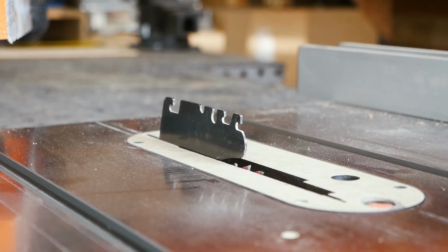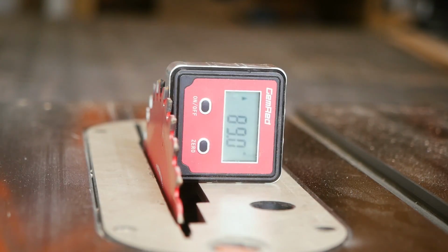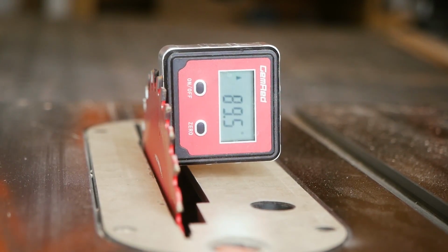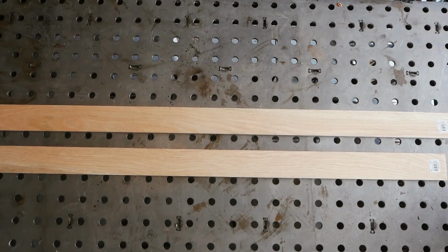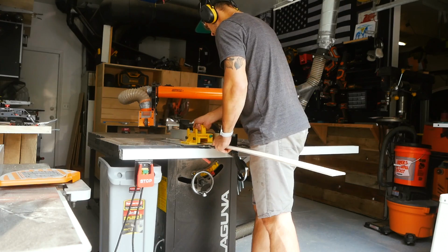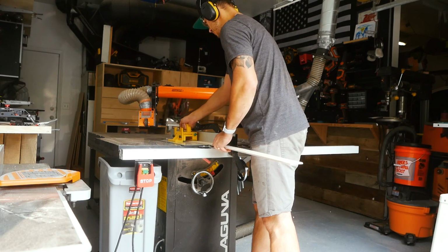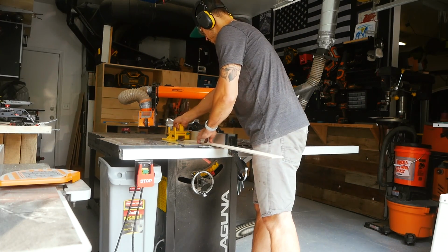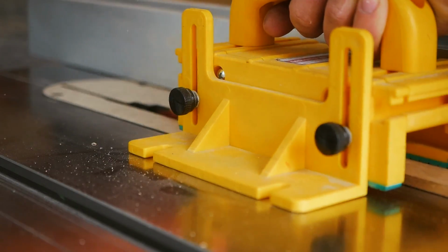Let's go. So right out of the gates, to get started, we knew we wouldn't be using a lathe to create the cylindrical shape for the beer stein. So instead, we're going to use angles. Now, to accomplish this, we went down to our local Home Depot and we picked up some of the 1/4-inch red oak. Now, we needed to create the angles on both edges to be a consistent angle throughout the entire cylindrical travel, if you will. And so the angle that we picked was 78 degrees.